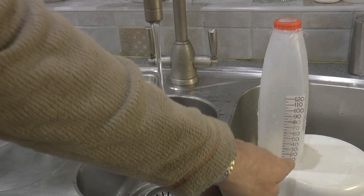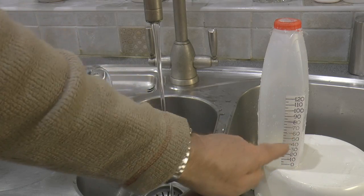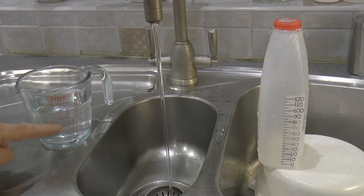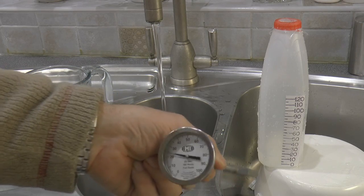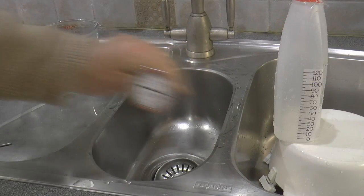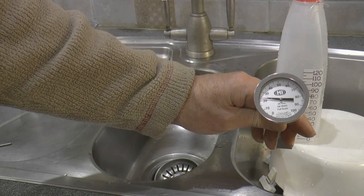So all we've got to do is to test this at different flow rates, energy flow rates, and relate this scale to some absolute standard. And then we've got a relationship. We have a comparator, not a calorimeter. And that's what this thing is. It's a temperature comparator which has been converted into a scale which reads watts. Once you've related those by a calibration chart, you've got a very accurate piece of instrumentation.